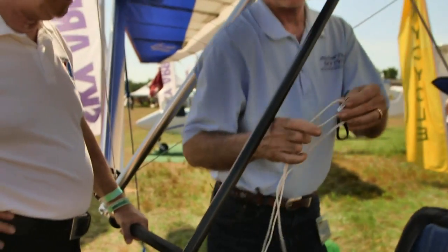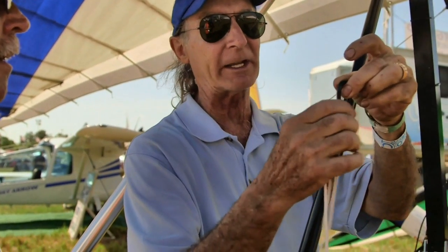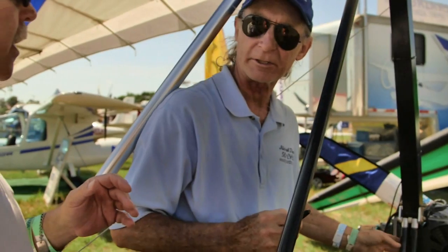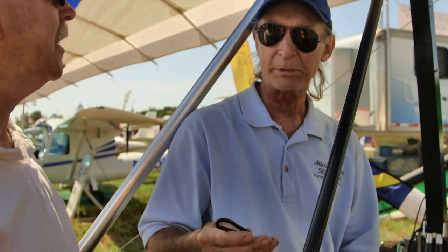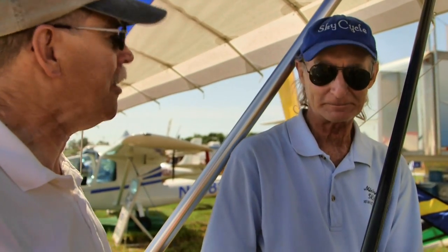I designed this pulley mechanism. This hooks on your mast — when you pull it down, you hook this on there with a jam cleat. It holds it in place while you're taking the wing off. And also when you're putting the wing on, you can put this jam cleat on here and pull it so the bolt is perfectly lined up — there's no struggling getting your wing on. Now the reason why you'd want to do that is because the wing wants to go up because of these struts. Yes, there are 250-pound struts on each one of them. So if you didn't have the restrainer mechanism here, the wing would want to leap up there — it would take two people to do it then.